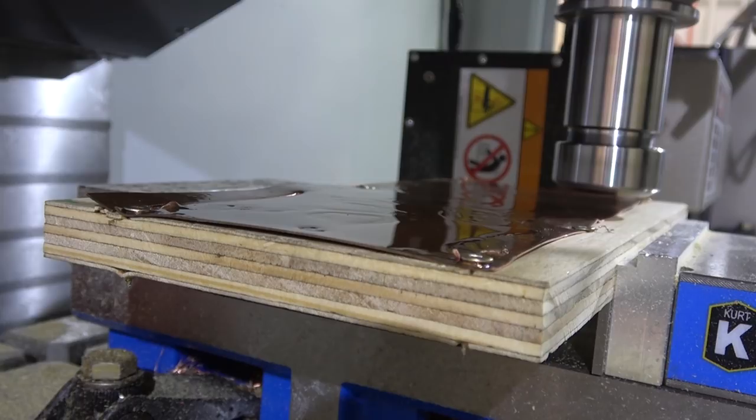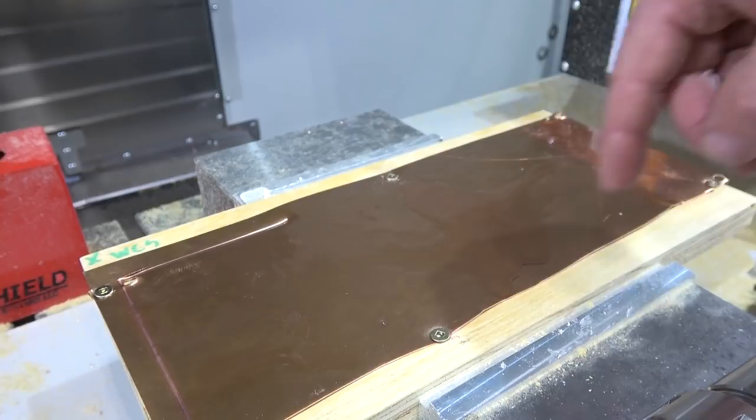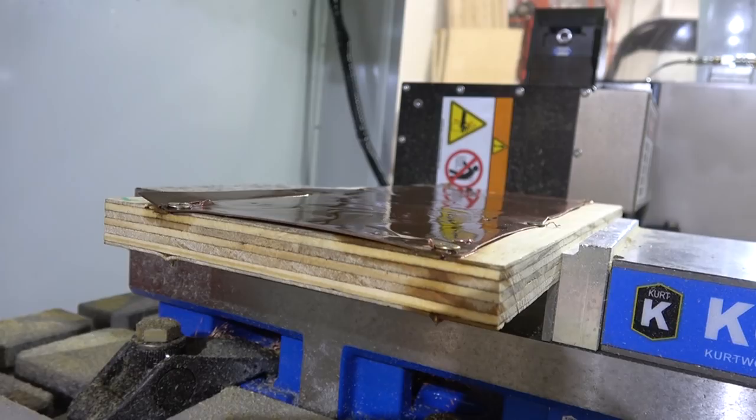Okay, we're good on the rotary axis. The tool flung out of the holder — I don't know what happened there. There's your trouble: too aggressive on that first plunge. I had it plunging 10 thou doing the periphery; this stuff's 22 gauge, so that's about 30 thou. That means it was pushing 40 thou — far too much for this little pin. For the second attempt I brought her up 25 thou, so it should only be taking about 15 thou for a cut. I think we're good here.